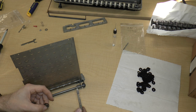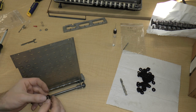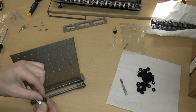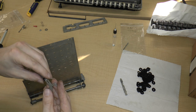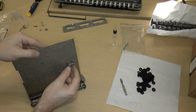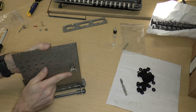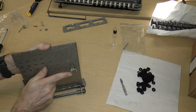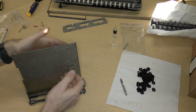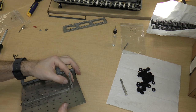Let me just check the video to see if we do get washer and felt on the underside. The reason that we would put a washer and felt is, for example, for this key stem, which definitely takes one of these. So we put a washer first, then a piece of felt, and that goes in like this. So when the key gets pressed down, this happens, but then there's a spring on the other side, so that when the key gets released, it smacks into the plate. And obviously you don't want that smacking sound to be very harsh and metallic, which is why they put this felt over here. So they would do that, and then on this side, they actually have a spring.